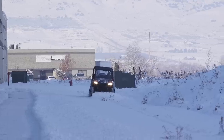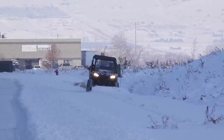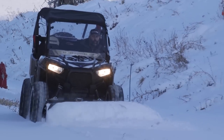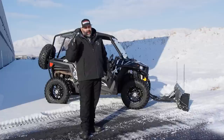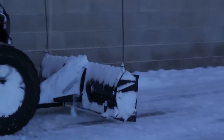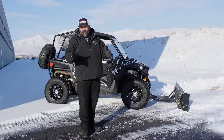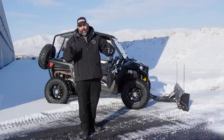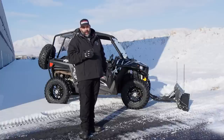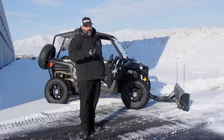Sometimes you'll do a couple of relief rows — you can push next to the edge first so that'll give you a relief area where that snow can go. Also make sure that you've pushed wide, pushed off the grass, so that there's room as these storms stack up and you keep stacking that snow. On the windrowing, it'll catch you out — I can almost guarantee. You're pushing down into a pile with your blade angled and you push into it and it throws your whole machine. Your machine's basically on ice so it doesn't have a lot of traction. You hit that pile and it'll just throw you to the side. It's probably worse on an ATV than a UTV, but it still catches you off guard because you were planning on compressing that snow into that pile straight on and all of a sudden you're going sideways.